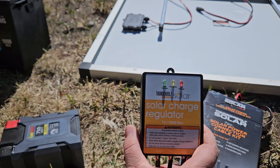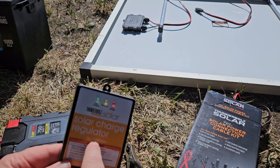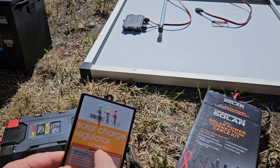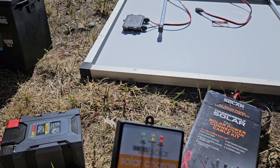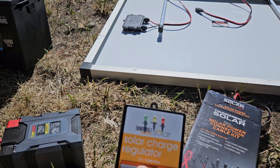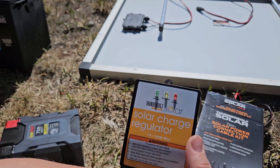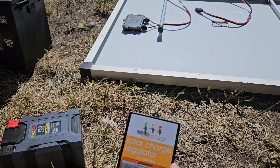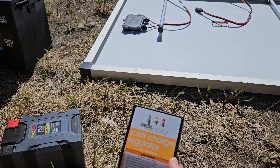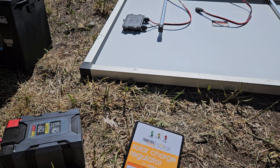This is your charge controller. What's important to understand is that this is 100 watt max. But that said, the reason it also says 7 amps — why is that important? Because a lot of solar and electrical stuff, when you get further into it and out of the simplistic plug-and-play systems, you're looking more at amperage and ampacity than you are strictly wattage. That was one of the first mistakes I had to learn when I started my solar journey.